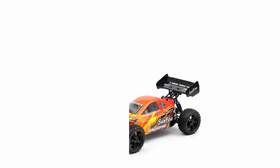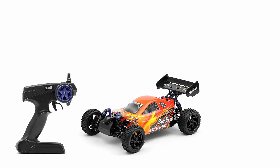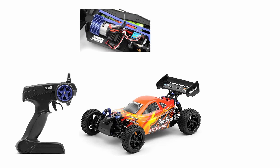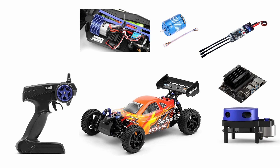In my case I had an off-road car from Sunfire that was controlled by radio frequency. The car had a DC motor to drive it and a servo motor to control the steering. I made a few updates to the car since I bought it 10 years ago, in which I changed the DC motor to a sensored brushless motor controlled by the famous VESC electronic speed controller. I also bought a LiDAR from LD LiDAR and a Jetson Nano which is the embedded computer.